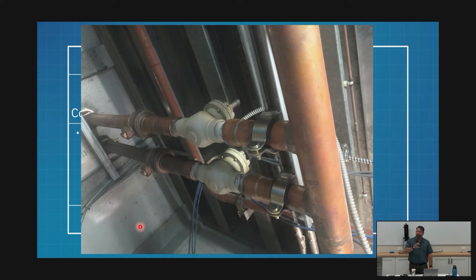If we're doing any piping work at all on this circuit, what I'm about to tell you is a critical, fundamental piece that has to drive your work. So here it is. If I have any difference at all in the piping between these two paths, when I'm at 100% coil, I'm going to load the side with the least restriction. And I'm not going to flow through the other side. And I'm going off on discharge. I'm going to be running really, really high pressure, 300 plus PSI, because of a minor difference in piping.